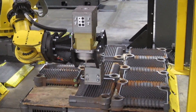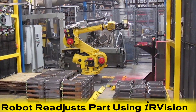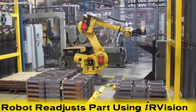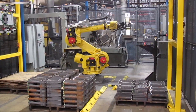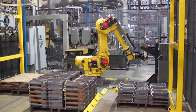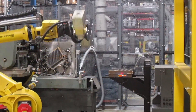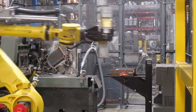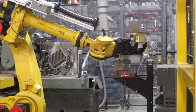The robot places the part on a re-grip station where a fixed IR Vision camera verifies the part and determines its orientation. The robot readjusts the part based on its orientation so that the part is properly aligned with the boring mill load position. FANUC IR Vision is crucial in determining this offset for robot pickup and bore mill loading.